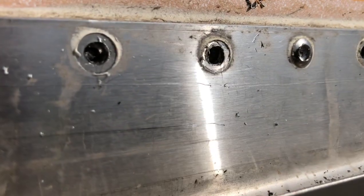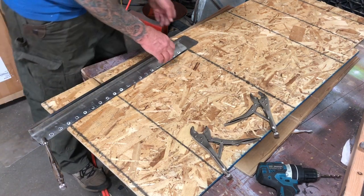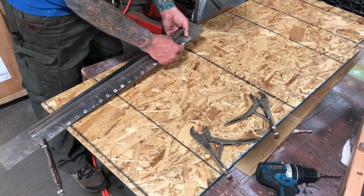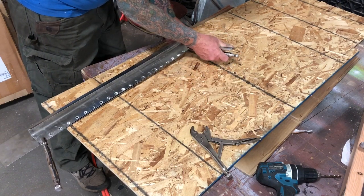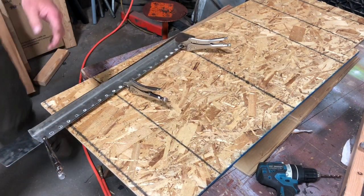Chris put me onto this: cut this piece before you bend it, lay the old one on top of it and drill the holes - otherwise you wouldn't be able to make them match up. But if you lock it in place it's like a drilling template. This is gonna work.